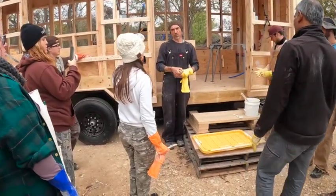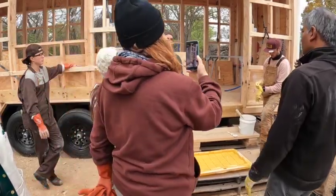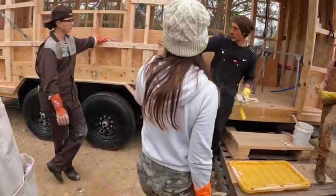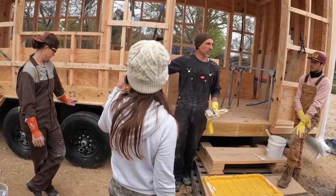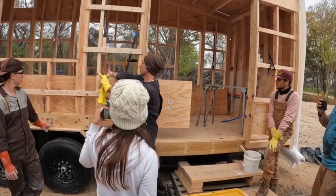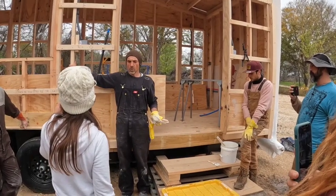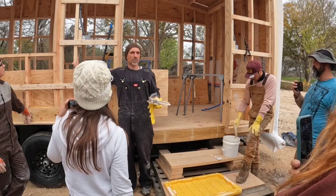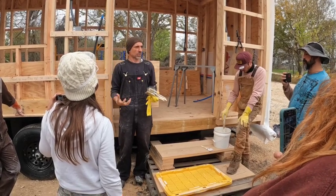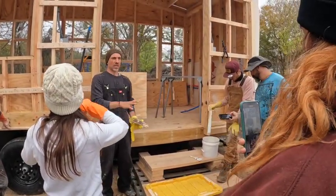And we're priming the structure to receive the hemp, and it's really important to get a good binding surface for the hemp to fix to. Obviously we added the nails with the discs, we added our horizontal pieces, and it's all really about keeping that hemp fixed in between the framing. When we encapsulate the frame completely, both sides, let's say we have 3 or 4 inches either side of the hemp of the frame, there's less need to do that inevitably. But what I also find happens if we don't prime the frame, the wood starts absorbing the moisture in the hemp, starts to soak it up, and that actually affects our curing because it dries it out a bit too much.